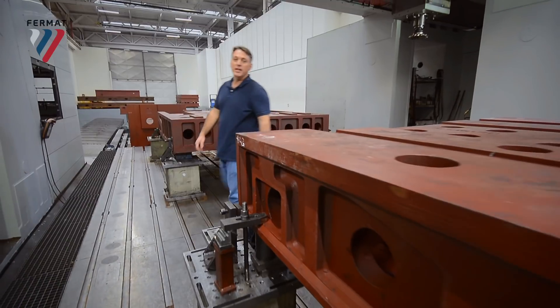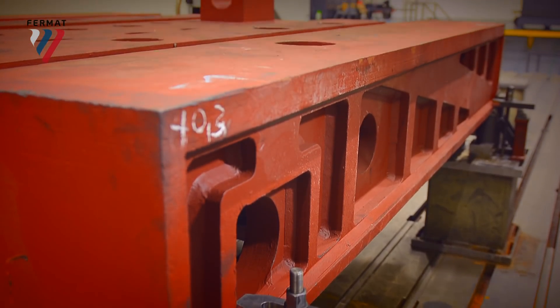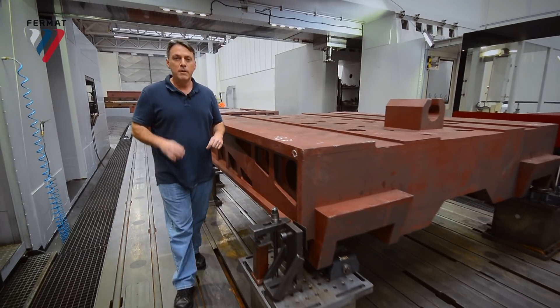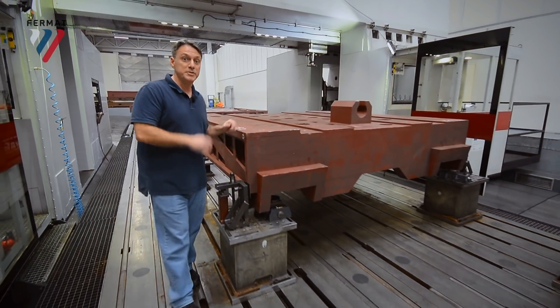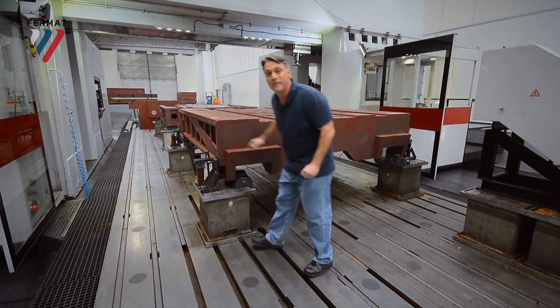We can do milling, machining, grinding, and laser hardening. You can work on one piece while another piece is being reset. We use this to make the pieces that go into our WRF series floor-type horizontal boring mills — extremely precise pieces. This is a saddle for a CNC tilting rotary table that can hold up to 80 metric tons.